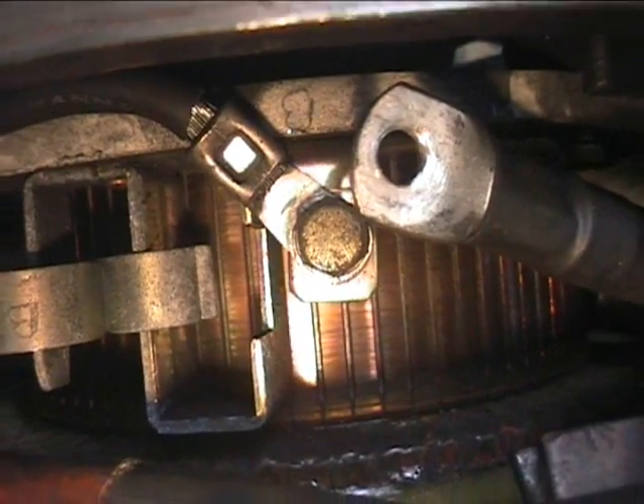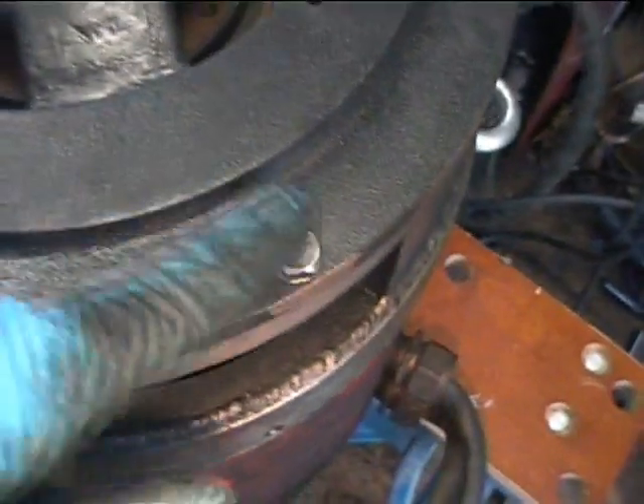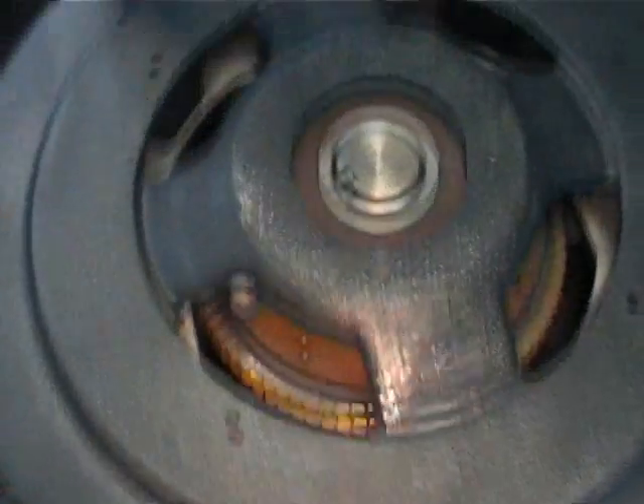See that guy in there — that's the hot one. And I think it's routed back here. I disconnected the negative. Yeah, there we go. So those two have now been pulled. That should leave the armature end plate here free to pull off. So I'm going to go ahead and crack off these studs and take it from there.